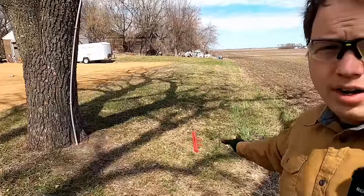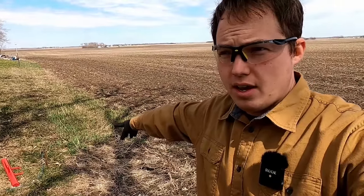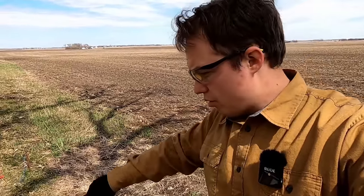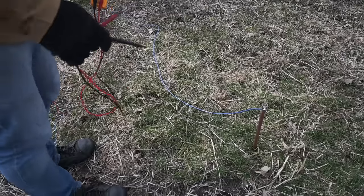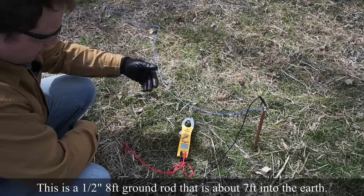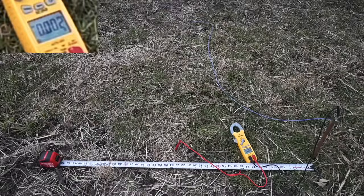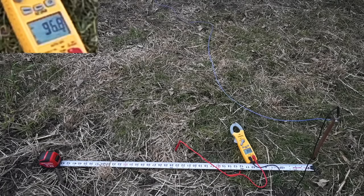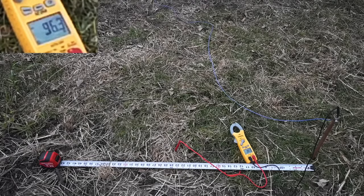From the rod on out, the ground will have less and less voltage. Right now the power is turned off to this ground rod and we have zero volts between the ground rod and the dirt a couple feet away. Here at the panel, I'm turning the power on. So we should have 120 volts at the ground rod, and then should be a voltage gradient coming across the surface of the ground. I'm wearing rubber-soled shoes, but what I want to avoid is touching the dirt closer toward the rod, because there is a voltage difference between where I'm standing and a foot away.